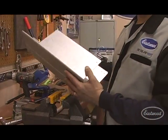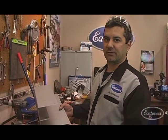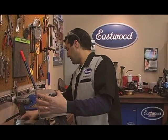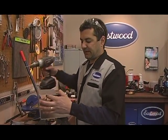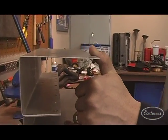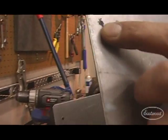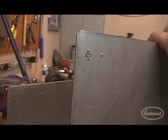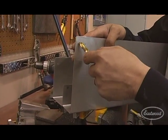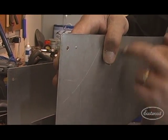Sheet metal — you're going to be working on sheet metal a lot with your projects, whether it's automotive, general fab, or around the house. Drilling holes through sheet metal, same thing. Once you have your punch through, you're going to end up with a burr on the backside every time. Easy way to clean that up: drill bit twice the diameter — just by hand, a couple turns — pull that burr right off.